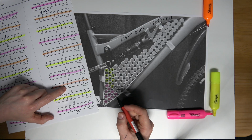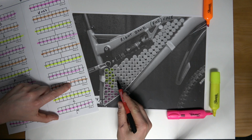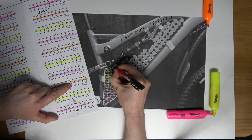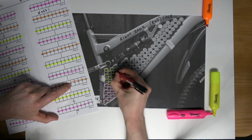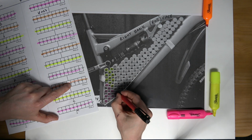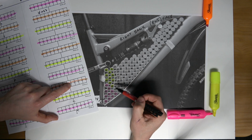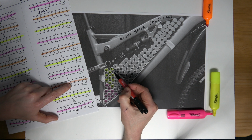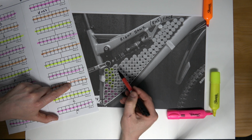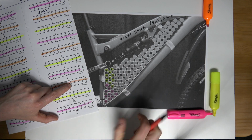So now I need to move on to the third string. I need to select these cells wisely. Okay, so I'm going to go down the way this time. So these cells will be negative polarity facing us. There you go. So there's 5. What do we see? 1, 2, 3, 4. There's 4 cells this time interlinking. That's important at this side. I'll not get into that at the minute, but I'll keep going.